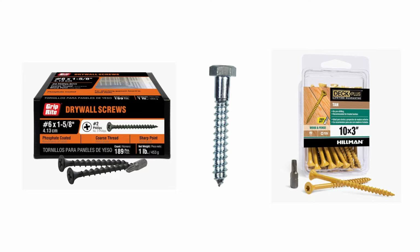Again, all these fasteners come in different lengths, different diameters, different head types. Drywall screws are obviously countersunk heads. On the far right, these particular deck screws are countersunk because you obviously would not want them sticking up or people could trip on the heads. But the lag bolts in the center, those are for really heavy-duty anchoring of wood structures. So you're framing something, you'd want to use lag bolts for that, like say a children's wooden playground set. Again, structural members underneath the deck, where you're driving those into 4x4s, 2x4s, 2x6s, heavy-duty lumber. You want those big heavy-duty lag screws.